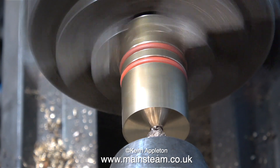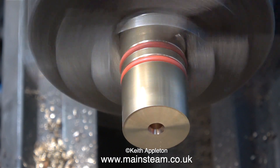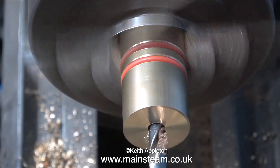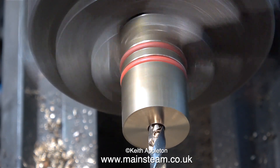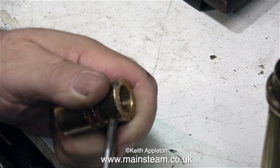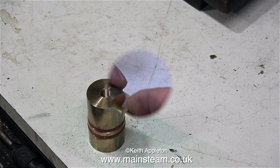I need to move it into the right position and eventually I'll be drilling a hole in the piece of metal to take the water outlet. At this stage a lot of viewers will be thinking, well, what am I actually making? I've done it this way just to keep you guessing. I'm making the bottom part of a water tank — the main water tank will be the chimney. That's why I'm using the two O-rings to stop the water leaking out. I drilled a hole from the outside of the plug to the inside and I'm threading this using a quarter by forty threads per inch tap. The plug for the chimney base is now completed.